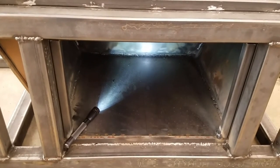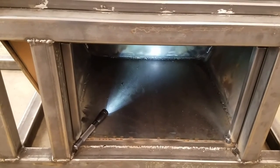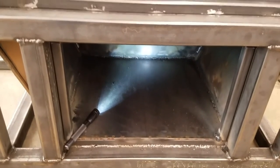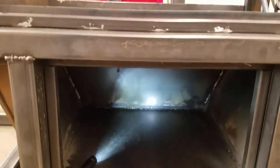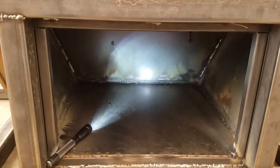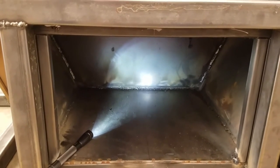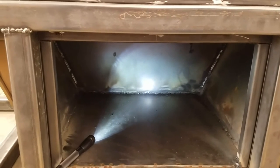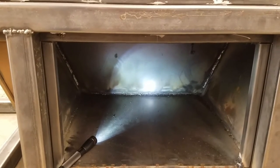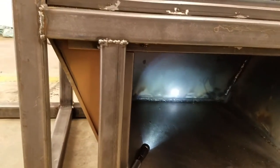This is part three of the smoker build and we've got the firebox done. It's all quarter-inch plate. We put the bottom down first, then the backside. You can see the walls are tapered — we did the back cut at the angle it needed to be, used that length to find what the sides are going to be, cut those, put them on there, and then once the sides were cut and installed, we used the cutoff pieces from the back to make the angle.